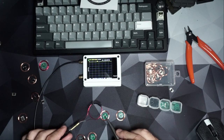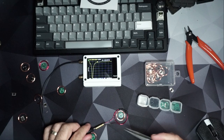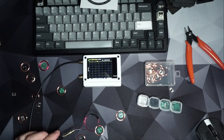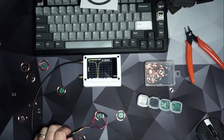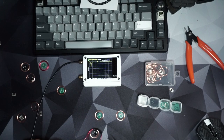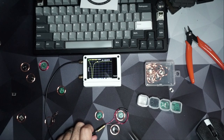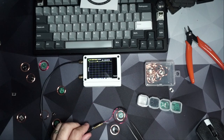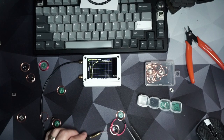That's what I would normally do here, but to save time I'll push that off to the side. Here is an example of it after it's been tuned — you can see it's dead on. My marker's at 13.56 and that is where the biggest power draw is. These two are examples of an antenna that is out of tune, but we're going to resolve it.